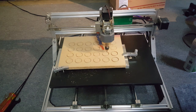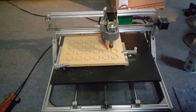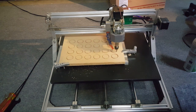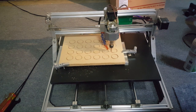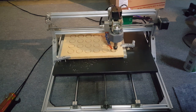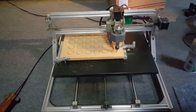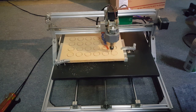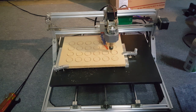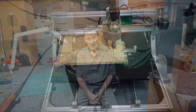It's more like a drill and it just goes right down in. The helix is at such a high angle that it pulls everything out of its way as it cuts. You can see I'm climb milling right now, which usually with a regular end mill would choke, but not with this one. It takes 17 and a half minutes to go down 100 thousandths, so this is far faster than it's ever been.